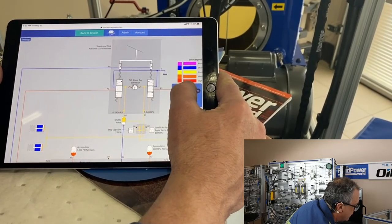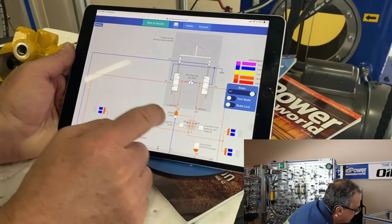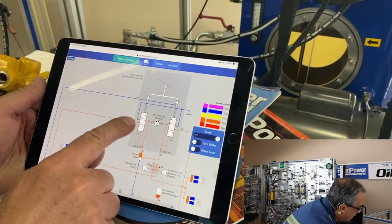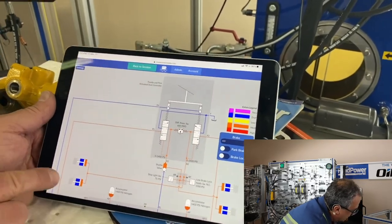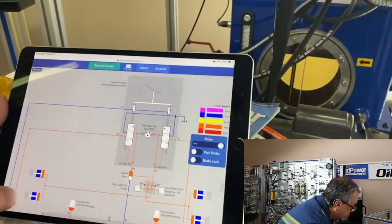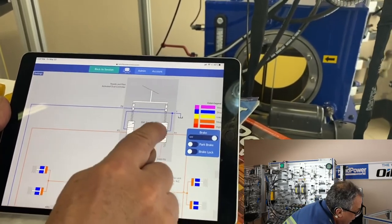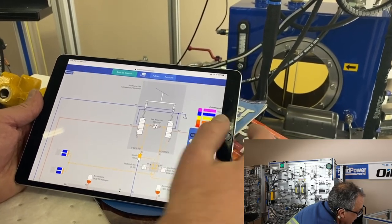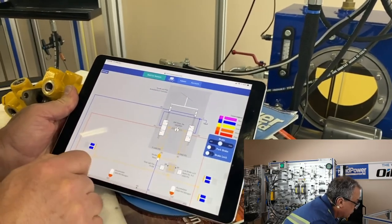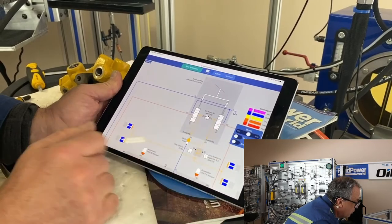What you'll notice again is that it's drawn a little bit like a directional valve. This is the symbol for the brake pedal there, and every time we tension that spring from the top, what you see is a little pop-down action. That little pop-down action grabs some more pressure from P1 — the brake pump and accumulators — or P2, and pops it through to a shuttle valve and over to the disc pack. Here's our depiction of the braking piston and discs in a disc pack, but as you know it's not some big cylinder with a 12-inch stroke — it's just a piston, everything packed pretty close together. As we take pressure off, it's got to bounce the other way in little pops. This valve can't spend any particular amount of time open — you're either going all the way to zero pressure or all the way to full. So it's a fight between those springs, just little pop-open, pop-shut moments.